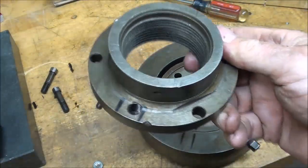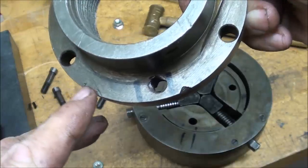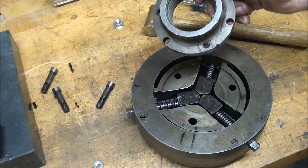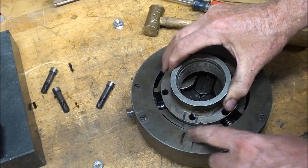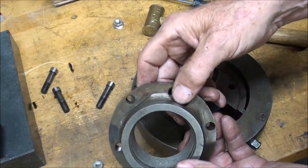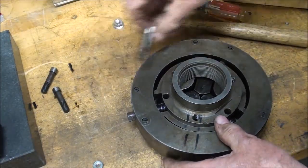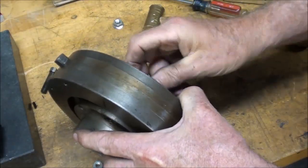I feel like an archaeologist when I'm doing something like this, but I just found right here the number 13 stamped on it. But part of it's missing, which means that it was machined off at some time or another to make a new backing plate that would fit on this. So either the old one was damaged or they needed this chuck to fit on a different machine. Now, my witness marks are magic marker, but there is the other witness mark that I found on here and a corresponding one that is on the outer edge of this piece. But I'm just putting it on by my marks. Right like that. Oh, he's going from the other side. And I'll do that off camera.